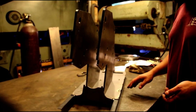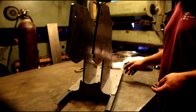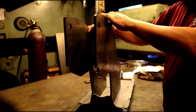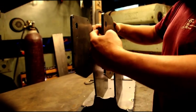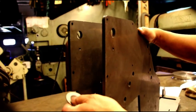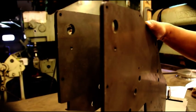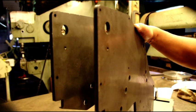We've got a few welds on our base. When you're welding your base, jump around side to side and different parts so you don't overheat anything and warp anything. These are the uprights — obviously these will go in square. On this hole and this hole, this is the heavy-duty model so it's got a bigger pin — it's got a 7/8 pin — and you need to weld a washer on each side of this. To make it easier we'll do that first. I've got two 7/8 washers that came with the kit.